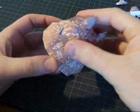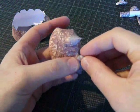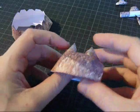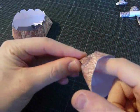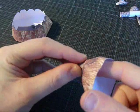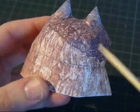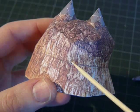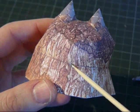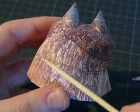Before you join these parts together, you have to glue the base of the feet at the top of the mount, because you have to press it from the inside out. You have to glue it really firmly because all the weight of the owl rests on these parts. When this cutting line here is straight above this dark line here, then all the wood patterns will match up nicely.